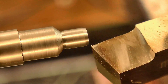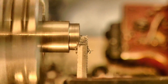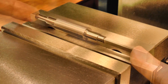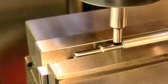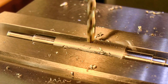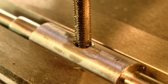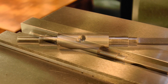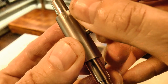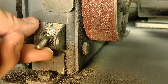The other bonus of fabricating the hook like this is that it can be replaced over time as it gets damaged by the spring. I then drilled and tapped the arbor to accept that threaded insert. The main body of the arbor now serves as a great little handle to hold the screw, while I use the belt sander to shape the hook profile.